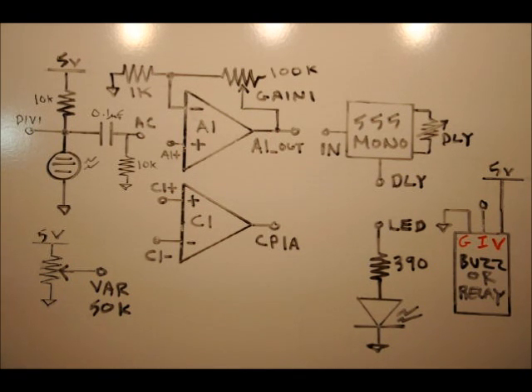I need a little more space here to talk about the resistor divider between our 10K resistor and our light-dependent resistor. This is essentially a variable resistor on its own that changes its resistance based on how much light is hitting the sensor. In darkness the resistance goes way up past 100,000 ohms, and when a lot of light is hitting the sensor we get between 1 and 5,000 ohms.